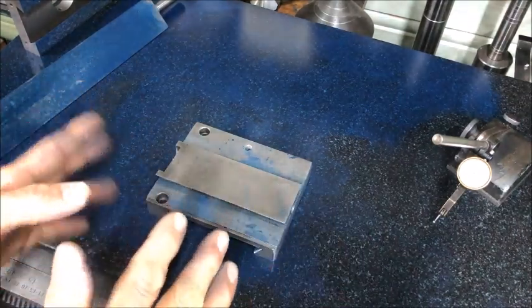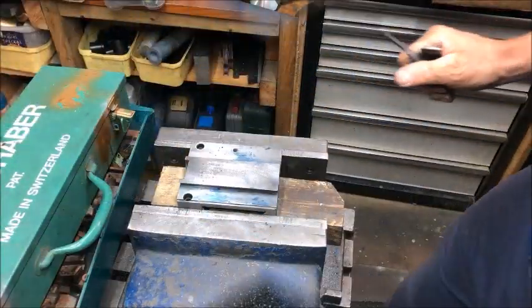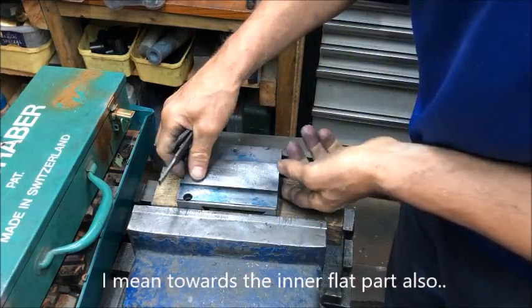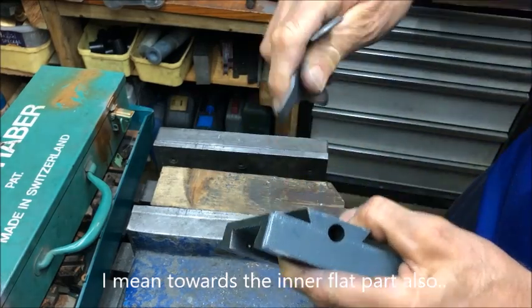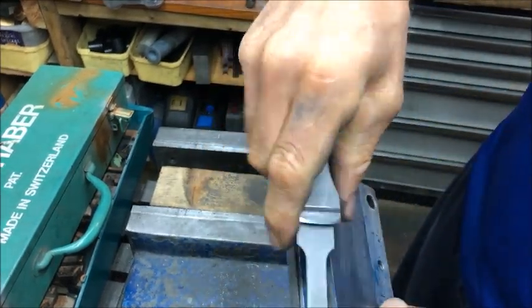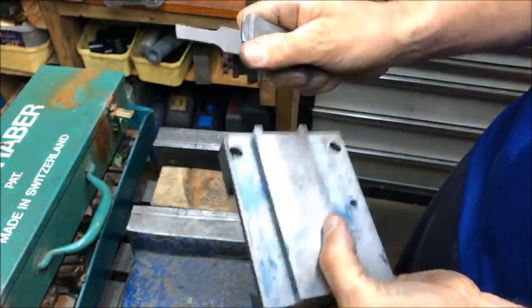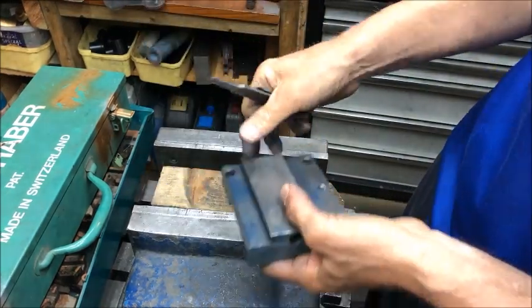So that's where I will scrape down. And for the dovetail — to get into the dovetail, of course I will relieve this so that I have a square cut groove down there, thereby avoiding at least to a degree hitting the opposite part.